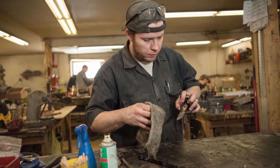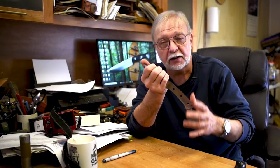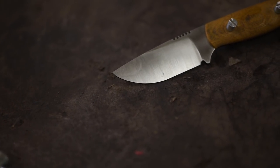Once the epoxy sets you can't polish it off — you have to dig it off — so it's cleaned while wet. We use a special cleaner that's very difficult to get: it's called denatured alcohol from the hardware store. The epoxy we use literally sets in three minutes. We usually leave it in clamps for 10 minutes just to be sure, but it's actually set and workable at three minutes. The clamps are then knocked off, it's cleaned again, and put on a rack.